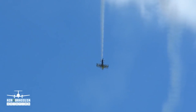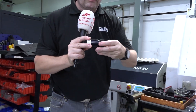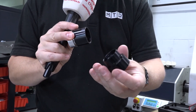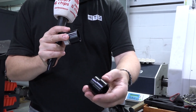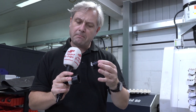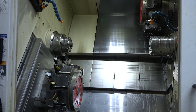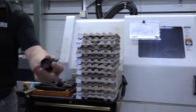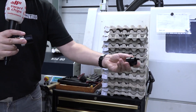One of the reasons they bought this machine was to make this part here, which actually comprises three parts — one, two, and three. It's a very intricate job: turned, milled, slotted, absolutely fantastic. What they were doing was manufacturing it in three parts because the main spindle would take 51mm but the sub spindle would only take a smaller diameter. So machine on the main, move over to sub spindle, and hold the smaller diameter there.